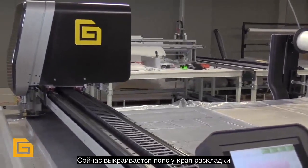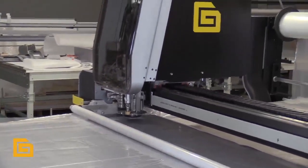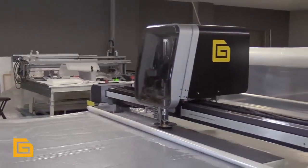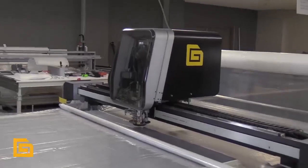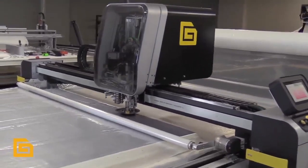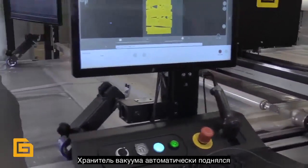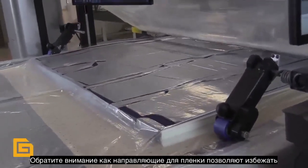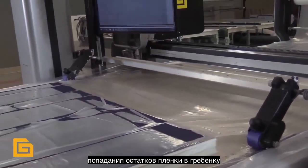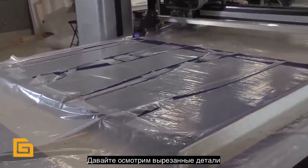We have a waistband to cut and a couple of flies. The receiver's lifted and the blast gate opened so we can dump the cut pieces onto the receiving plate. Notice how the poly guides are assisting the poly overlay off the cutting surface, so we're not damaging the fingers or damaging the jersey. We'll go ahead and take a look at these cut parts and help Jim clear the poly off.